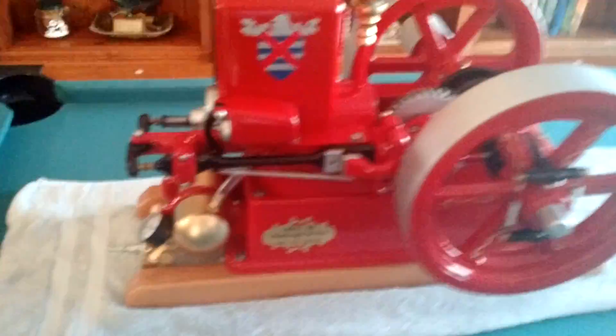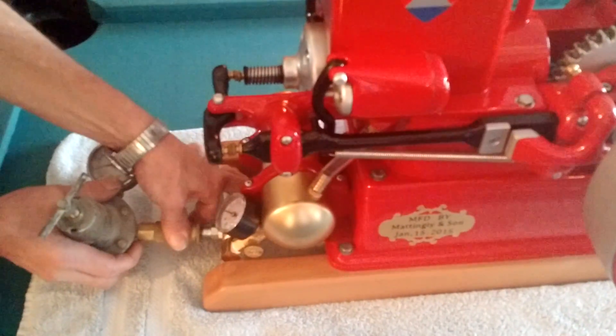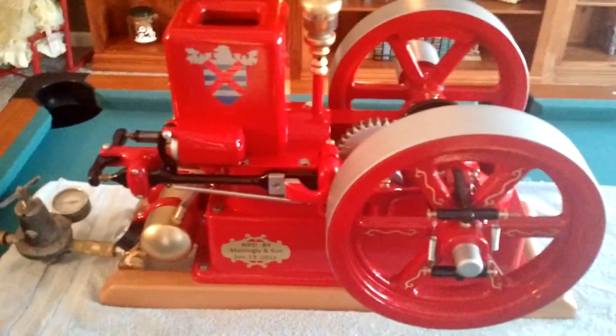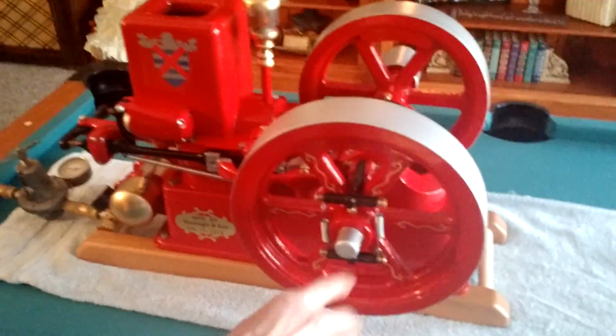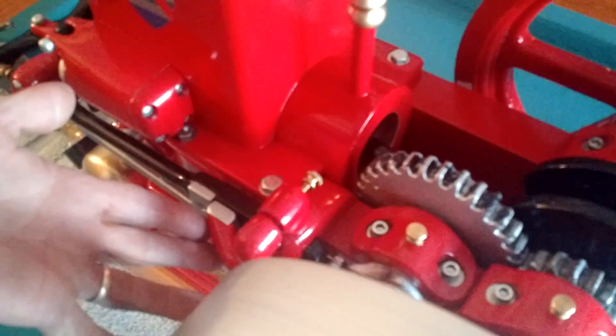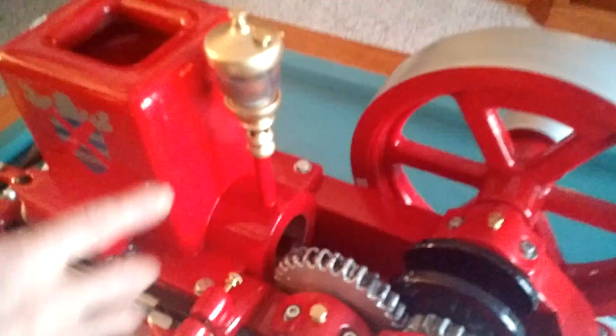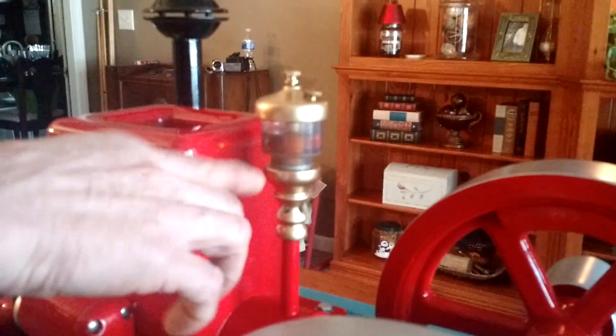I'm really nervous about this — it's the first time, I'm excited and scared all at the same time. We're going to start out with slow air pressure and gradually increase. Our first goal is just to get the thing to run, the second goal is to get it to miss. This is actually a throttle — if you screw it in, the spring causes more tension, making the engine speed up because it takes more force to latch out. The oiler here actually works — it's a dowel rod repurposed from a liquid candle.